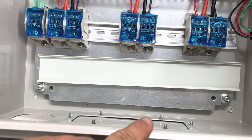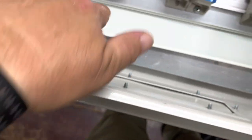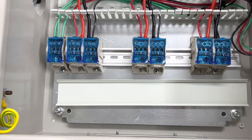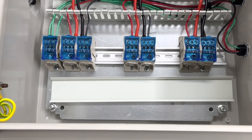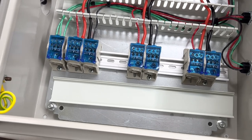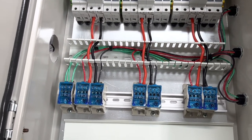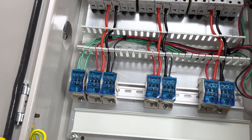I'm going to have three number four aluminum URD cables which will come up through this two-inch hole and then fan out in here. I'm also running three more cables from my electrical room, because I can stack a maximum of six inverters.